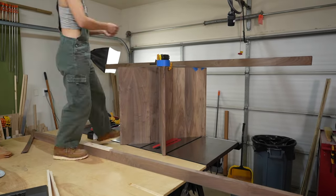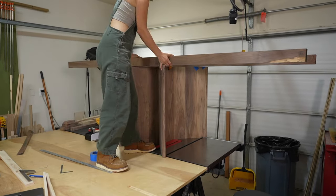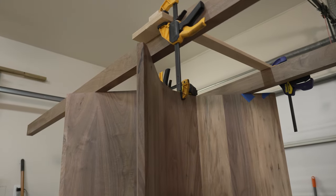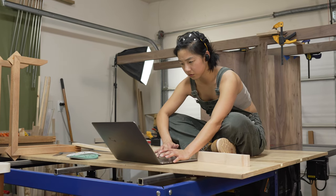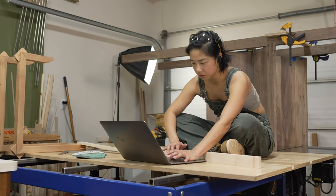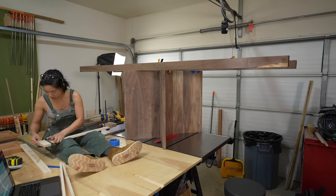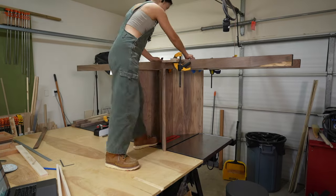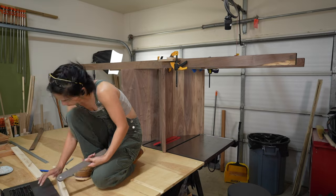Low key, I was actually very proud of my use of markings and blue tape. After getting the positioning where I needed it, it was now time to think about how I was going to clear out the space - a full dado or a half lap? A full dado means essentially making one deep slot on the batwing. With a half lap, you'd cut half out of the batwing, half out of the stretcher, and then link them that way. I contemplated between these options for quite a while, but in the end I decided to go with the dado cut.